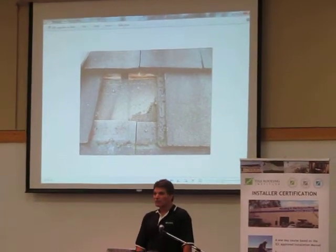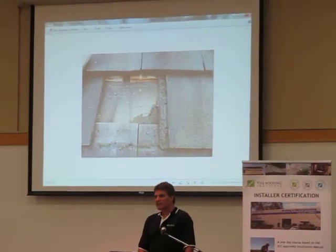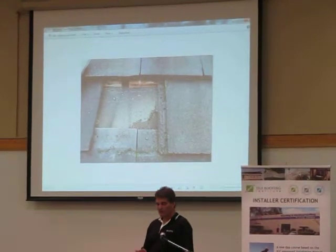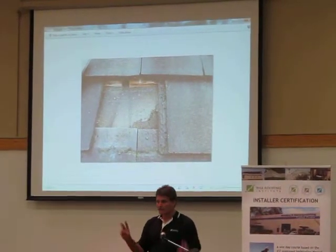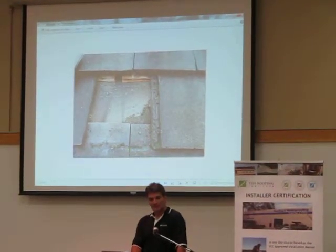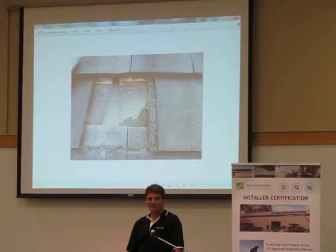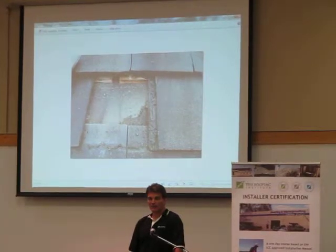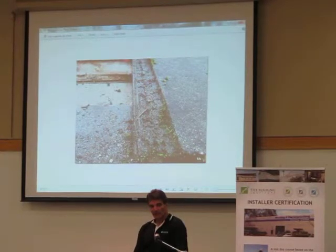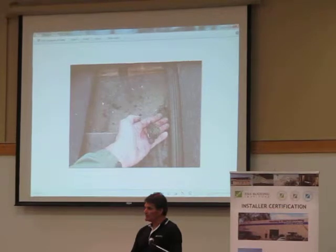On commercial buildings near really big busy streets, there's fine sediment that can get up there. You can see the leak on this roof — you can see the water on it, the felt is dry, the battens are right above — but look at the amount of sediment in that water channel. That's what's causing the leak. You can see all the sediment built up, even moss growing, and when you clean it out, that's how much junk came out of just that one water channel.